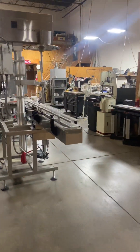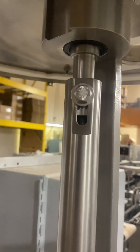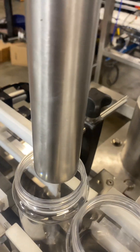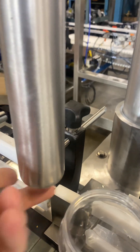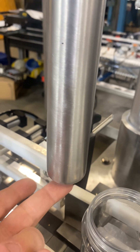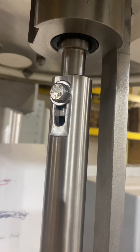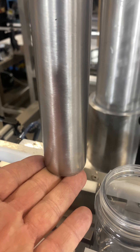Right now you have your auger shaft here that has a slot in it — that moves up or down. The auger will need to be at the bottom. There's a lip under here; you can feel the lip. The auger needs to be almost touching the lip. So if you take this out to clean it and put it back, it needs to be almost all the way down, almost touching the lip of this funnel. That's how you run non-free flow.